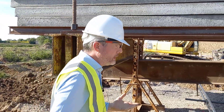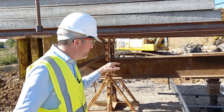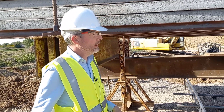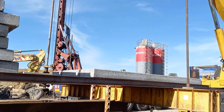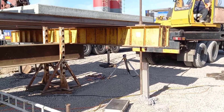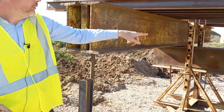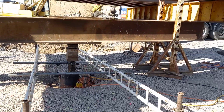These are the sort of conditions where you would need a working platform for piling plant. To verify this, we need a large plate load test. What you see around you is all the reaction frame needed to apply the load — in order to push a plate down, you need to react against something. We've got CMC columns installed on the four corners of the reaction frame, acting in tension.